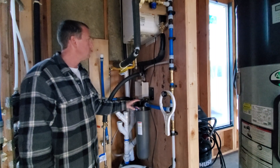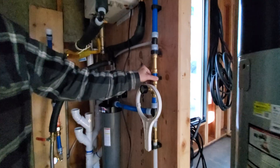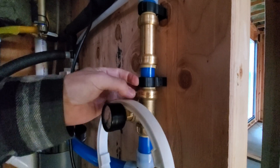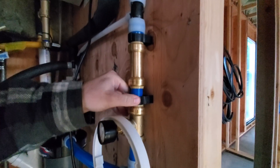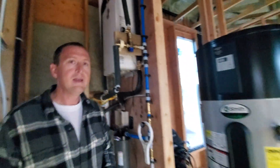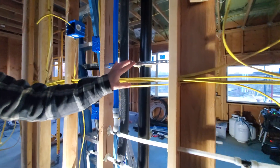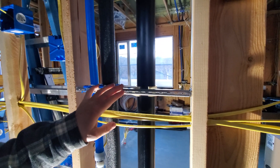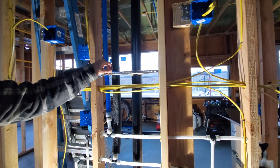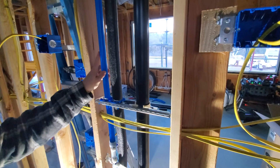The rest of the rough-in work was mostly about finding the right supports. There's this plastic little gadget that screws into the wall and clamps around the PEX — you shove it in and it just grabs it. Another type of bracket fits between the studs or trusses, anywhere from 16 to 24 inches apart. It has little brackets you screw wherever the pipe needs to go, and a clamp piece goes over top to hold it nice and sturdy.